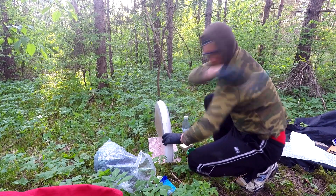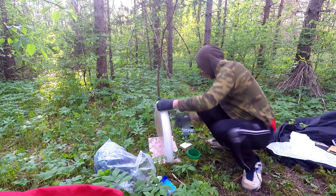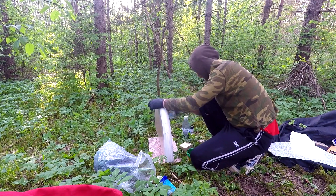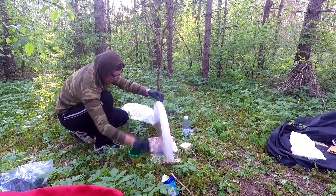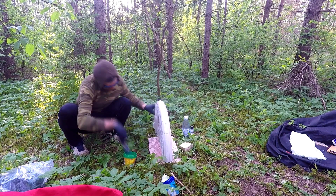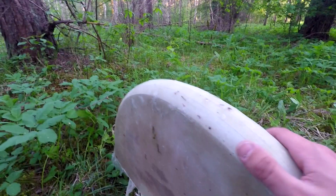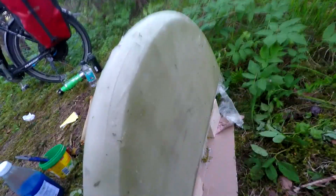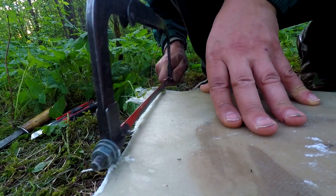The smell is just so bad it makes my neighbors angry. So I decided to go to a forest near my home. Here I make the first fiberglassing of my life. The first mosquitoes were out and made my existence on earth feel like hell. The polyester resin rises quite quickly — it thickens and is not comfortable to apply on the surface, so I have to do it fast. The choice of fiberglass was completely arbitrary for me. The next day, the mold dries up beautifully. Of course, a few small pieces of nature had dried into the mold. It didn't come out as perfect since it's my first fiberglassing, but it was as excellent as I expected.